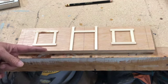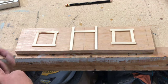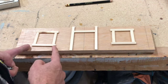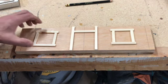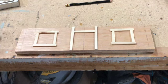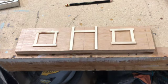Okay, I set the windows 3/4 inches off the bottom, and I think actually I'll just give you the dimensions. I'm at 2½ on this length, and I think I'm a little tall here. I've got 1 3/4. I think I'd cut that down to 1½ because I think that's just a little tall for my liking. You make your own decision. You can determine the detail you're going to have at each corner. I kind of like this look. It's kind of a country look.